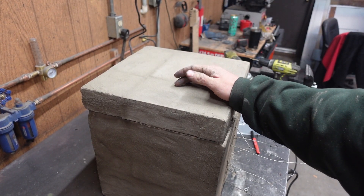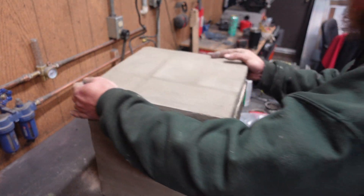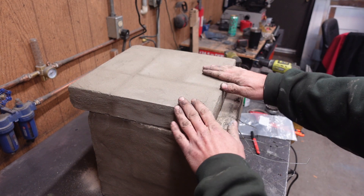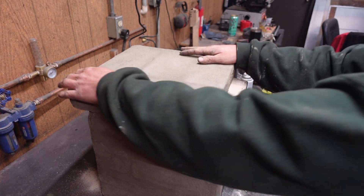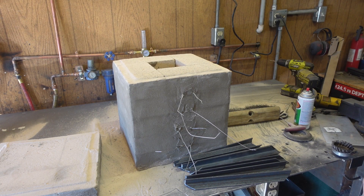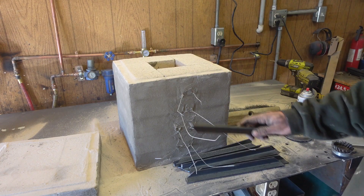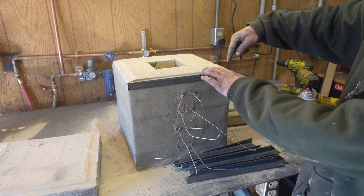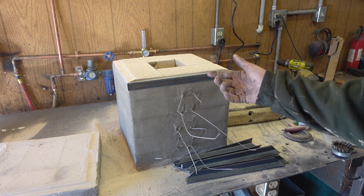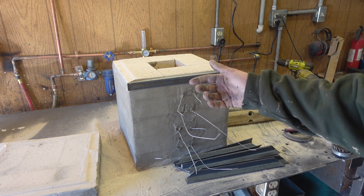All right, we can start framing this thing out with angle iron. I think the first thing we got to do is a little shimmy here, because the fire brick will wear itself down and that way we know we have two perfectly mating surfaces. So these guys go right in these notches here and it's going to encase the entire thing all the way around. We're going to MIG weld this because I want to — not because I'm an idiot and left my bottle of argon open all night and it all drained out.